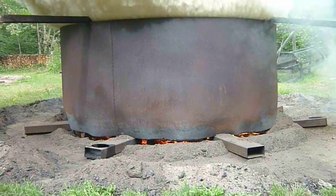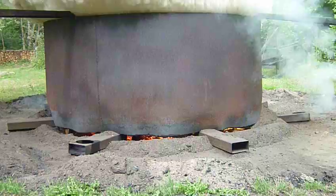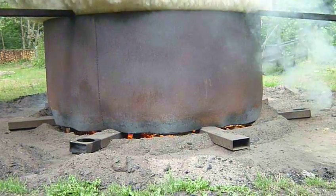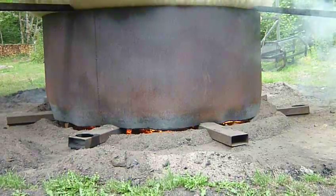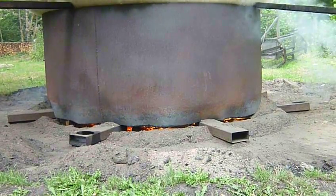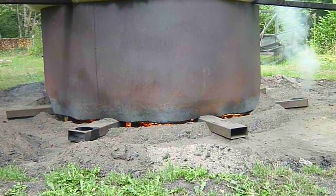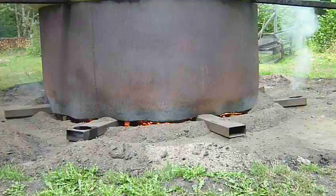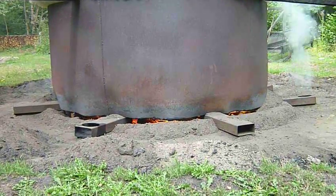That's the heat that I'm looking for. I'm looking for intensive heat around the shoes that haven't got the hole in, because in the next couple of hours they will be the only supply of oxygen into the kiln. If it's hot by those shoes, it automatically starts sucking — which is what we're looking for. When the chimneys go in it also helps that process.